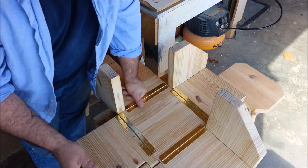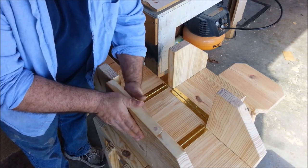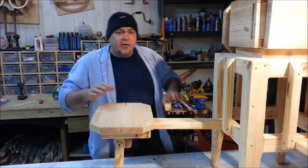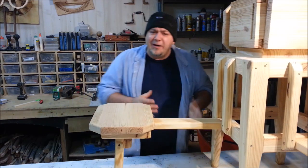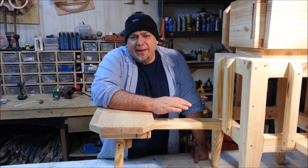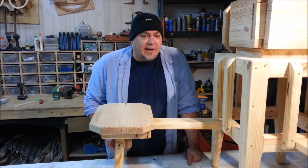The one thing that was a little tricky: the side of the piano hinge needs to be basically flush with the side of the tabletop. So when it folds up, the top of this wing is in line with the side of that tabletop — and that makes sure there's plenty of room for those seats to come up and fold into it. Just like the wings on the top, the chair arm and the legs are also hinged using a wooden hinge and a wooden pin. The reason I did that is to cut down on cost. To buy high-quality hinges without a lot of play gets pretty expensive — if you add a hinge here and a hinge here, that's three hinges per side, so you're talking 12 hinges at four or five bucks a piece.